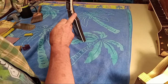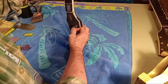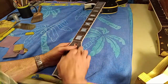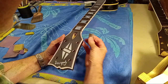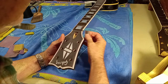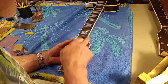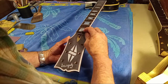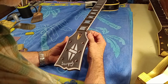That's easier to hold. If I know that I've got to transition the backside of that binding to that wood, I'm going to work it from the front. And I'm going to just hold that up, and I'm going to watch the width of that. I'm going to cock my razor blade on that angle. And I'm not even going to look at the wood back there. But what am I doing? I'm keeping a hawk eye on that width of that binding up front, and I'm making certain that I don't roll over and mess that up.